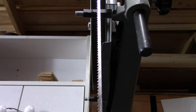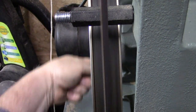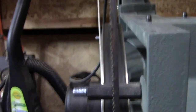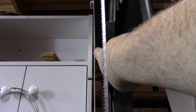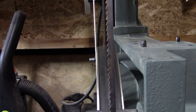We're back again with our string and we have our band tracking better. Down here on the bottom wheel now, the band is more in the middle of the bottom wheel — that's a lot better just to begin with. As I pan back up and put some tension on the string, it just barely touches the bottom. Just as the string starts to touch the rims on the bottom wheel, right there at the bottom it is just touching the top one. That's darn near perfect. I like that a lot.